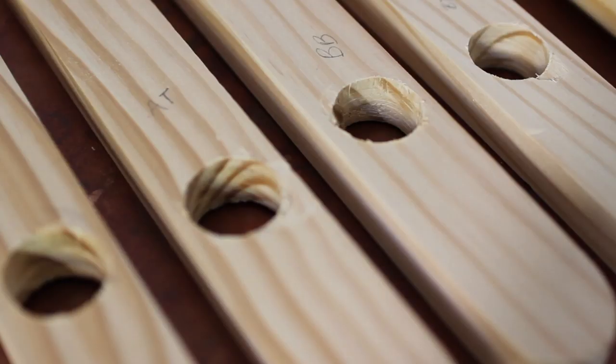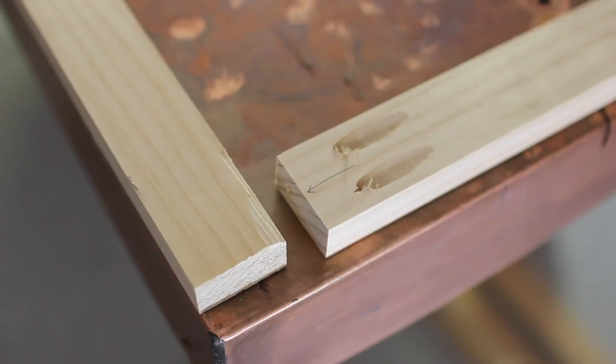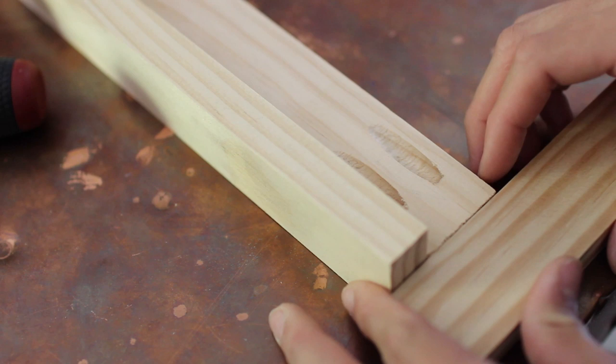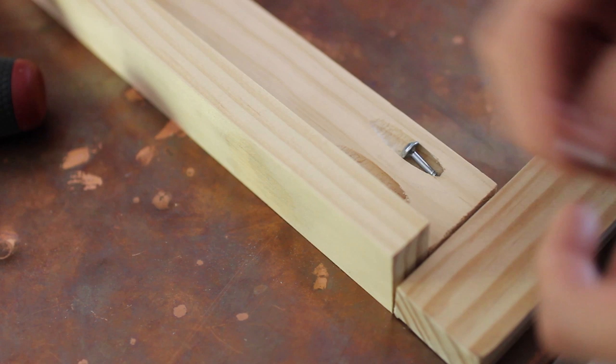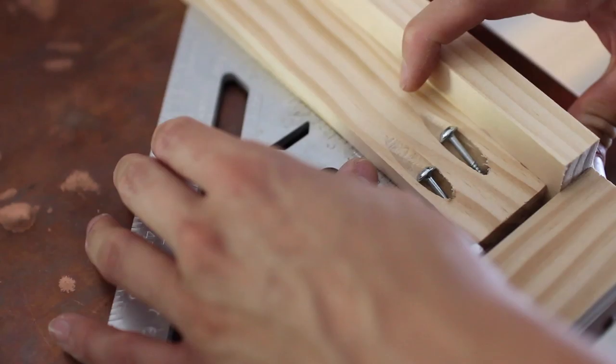The legs are handled, so let's go ahead and assemble the shelf. You can glue this together and screw it from the outside if you don't have a pocket hole jig, but I like the pocket hole jig since it gives a more secure hold while also hiding the screws. Make sure when you are screwing into the 25 and a half inch piece you don't screw all the way to the edge — you want to leave that thickness of the piece of wood that we compensated for earlier on each side, since the pieces on the outside are staggered.